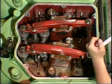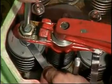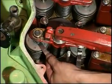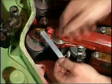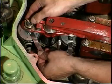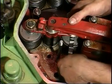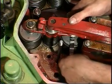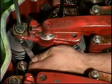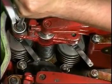Leave the feeler gauge in position and insert another 0.4mm feeler gauge between the second spindle and valve bridge. Tighten the adjustment screw until the correct clearance has been obtained and tighten the lock nut. Check simultaneously that the clearance is correct at both valve spindles. Finally, make sure that the 0.5mm feeler gauges marked incorrect cannot be inserted between the spindles and bridge. Repeat the procedure for the exhaust valve spindles, this time using the 0.9mm feeler gauges marked correct and the 1.0mm feeler gauges marked incorrect.